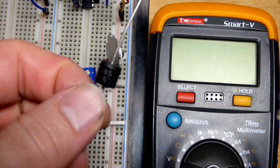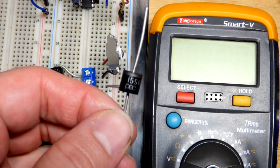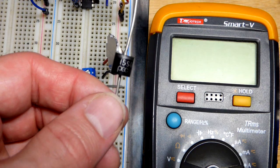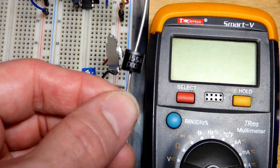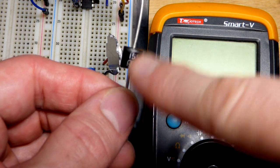In this video, we're going to look at a Schottky diode, but this is a different one than we used in a recent video. That one could only handle about 15 milliamps of current - surprisingly low, but that's what the datasheet said. The part number for this one is 15SQ045, and the '15' in that part number is important for knowing about the component.